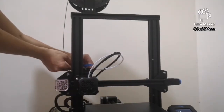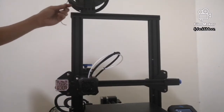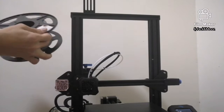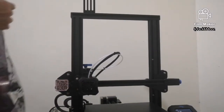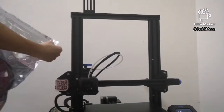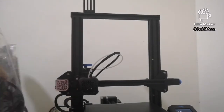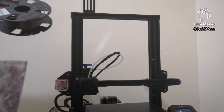I think this is caused by wet filament. To prove my idea, I decided to take down the spoilt filament and replace it with another one. During the removal of the filament, the filament snapped — this is also one of the observations you can make if the filament is wet. I changed to a filament which is properly kept in a sealant with silica gel.